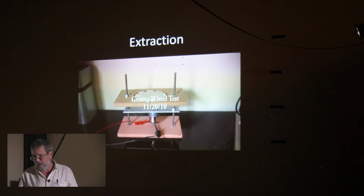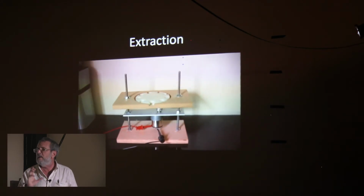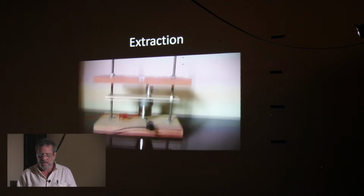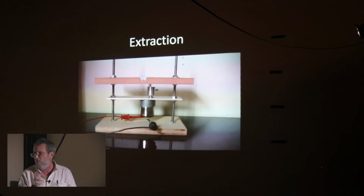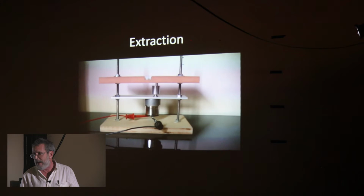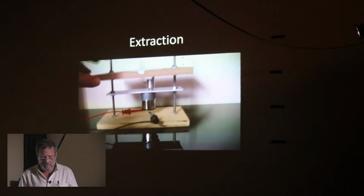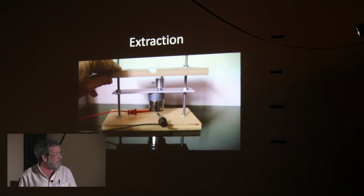So the next step was to figure out how to meter them. The last one, there was nothing wrong with that, except I didn't want to sort them continuously. I wanted to meter one at a time. And so the next step was to figure out, how do I spin that disk one M&M at a time? And for that, I used a Geneva mechanism. And you'll see in a second, I'll tip this up, which is a very old mechanism for converting rotary motion to an index motion.